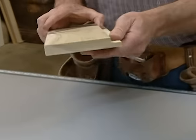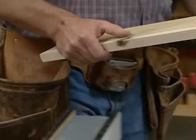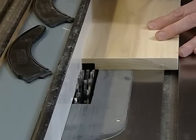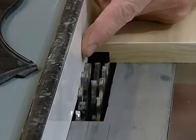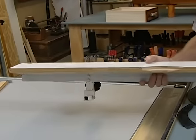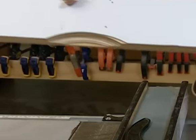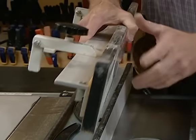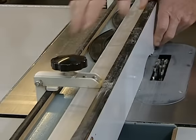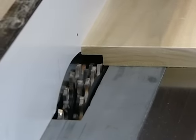Let's talk about rabbets. The definition of a rabbet is a two-sided groove cut in the edge or the end of a board. I can make a rabbet on the table saw using the dado. But look what happens when I slide my fence over to align with the rabbet — I'm hitting the fence. I don't want to cut into my fence and damage it. The way around that is to install a sacrificial fence. Here's one we've had for years — it's a piece of plywood covered with high-pressure laminate, very slick so material slides by easily. On the other side there's a heavy-duty angle and clamping devices to secure it to the rip fence. Once in place, part of the dado goes under the sacrificial strip and not against the fence.